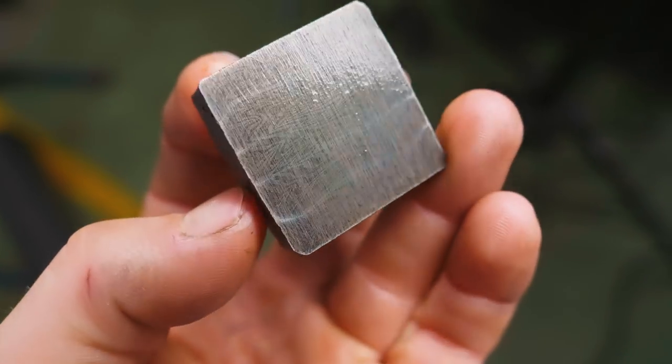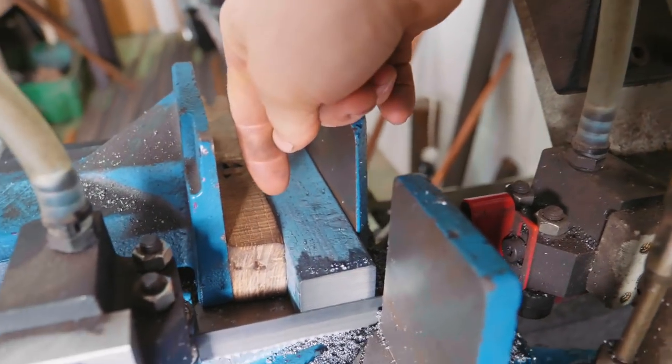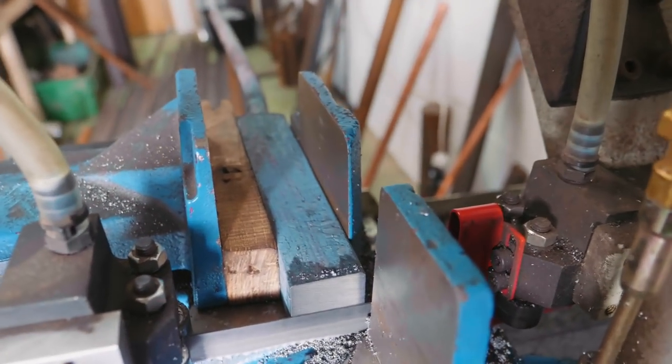We've got a really nice fine pattern there. This is awesome. So I like the pattern. We're going to take this piece. We're going to take a couple inches or so of this. We're going to cut a slice off. We're going to run in the forge and we're going to upset it and forge it down into some flat bar for Simple Little Life to use.